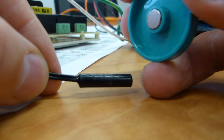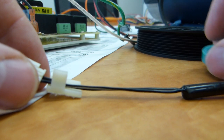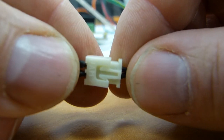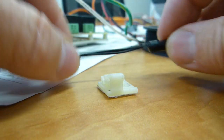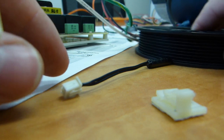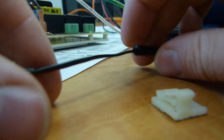Okay, so magnetic field, move some electrons, it generates one very low voltage signal that moves along on this wire. The wire continues in this connector. The connector itself comes apart like so, so you can take out this piece, disconnect it from its clip, disconnect it from the machine. That's where you find it, along the frame, somewhere along this pulley that drives your track, and that's it.